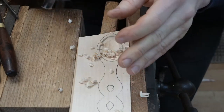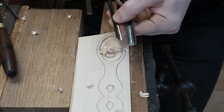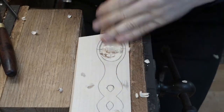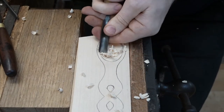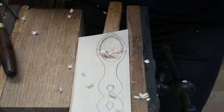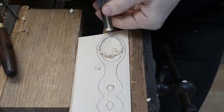For those asking about a beginner set: I would recommend a couple of fingernail gouges. For instance, one there and one there for doing our little flowers, and one for doing the bowl and the back of our daffodil — those sorts of gouges for starting out will allow you to do quite a lot of work. As we were saying, if you contact people like Ashley Isles, Sorby, and Henry Taylor and ask for a beginner's set of wood carving tools — you don't need a lot. I would also suggest you only really need one V-shaped gouge for our style anyway.